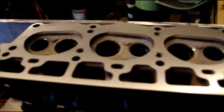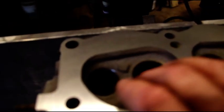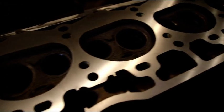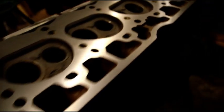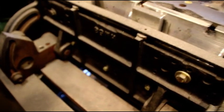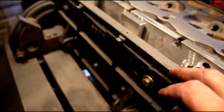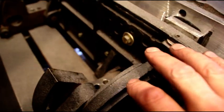If you want to save your head and cut it and make it perfect, it just takes a little bit of time. I'm going to leave it on this jig and next I'm going to cut the intake and exhaust seats while it's here — it's just easier to do it when it's in a rigid setup. That's the setup for cutting a 258 head and any kind of long-type head. The jig goes every which way, so you can cut the intake manifold surface on a V engine head, or you can deck it like I'm doing here. Usually you can just bolt your head to the jig and go, but I had to use jacks on this because this is a very heavy and very long head. That's just what it takes to set up a 258 and get it perfect.